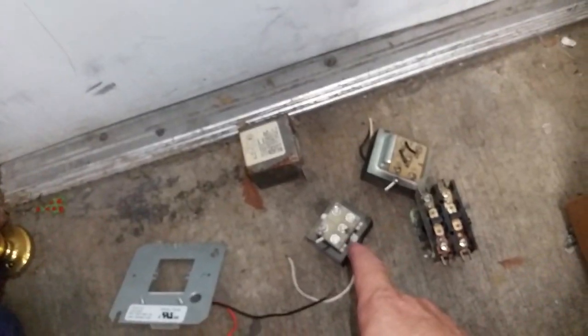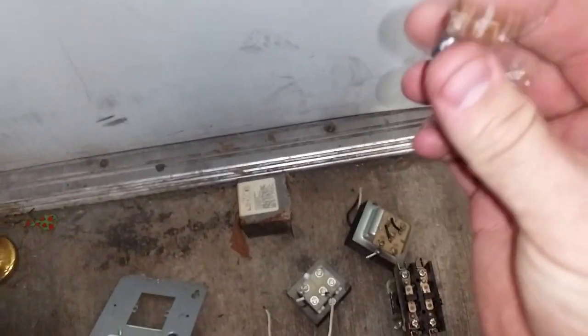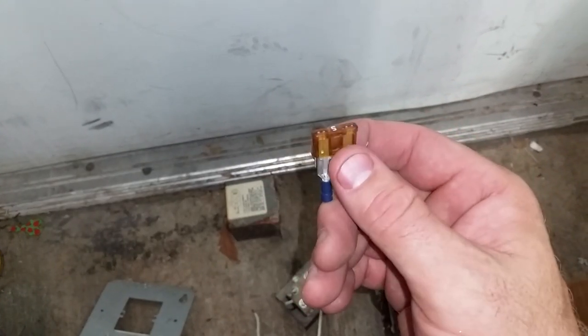Okay, and many different systems use different wiring colors, so when you're hooking up the transformer and you want to put in a fuse link, you don't want it on the neutral or the common wire. You want the fuse to be before the load. So hope that makes it clear.